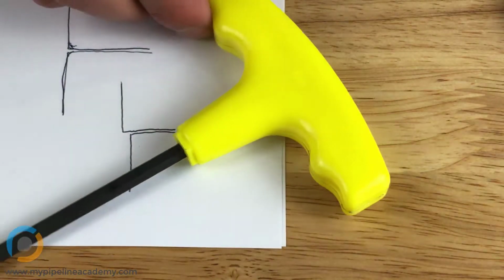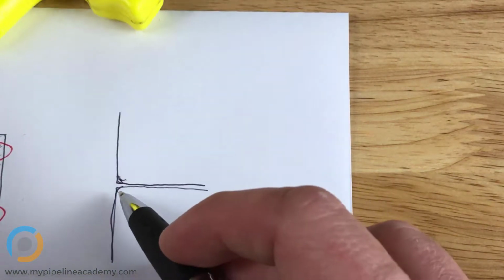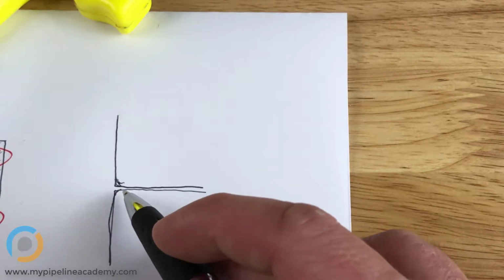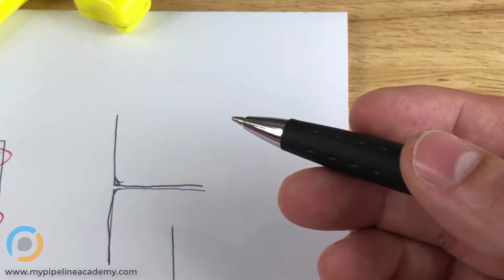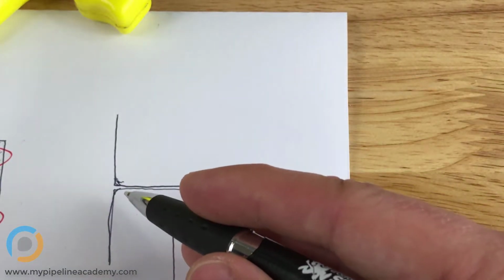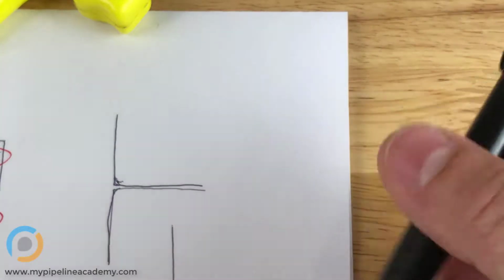Couldn't a pronounced parting line like this one also be shown because the maintenance on the tool is not the best? Could be. Over time, tools wear down, certainly. And we talked about the rounding of corners over here. You might start off a tool where there's only a few thousandths of an inch radius on those corners, which is pretty good, but over time, you shoot 100,000 parts or 1 million parts, and there's some wear that happens, some degradation on those corners, and they would become more rounded over time.